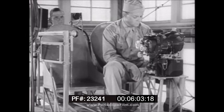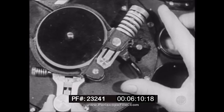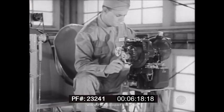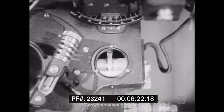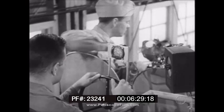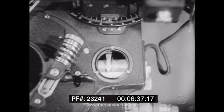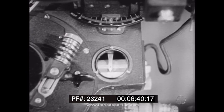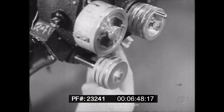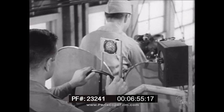What makes the brush move? Center the sight, start the trainer — we'll take a ride without bothering about a target. Clutch in the stabilizer, and the gyro will control the movement of the sight. Just watch the brush this time. Turn the sight to the right with the turn knob, and you move your line of sight away from your heading line to the right. Reads the same amount, doesn't it? You turned your sight, but the pilot changed the heading the same amount.